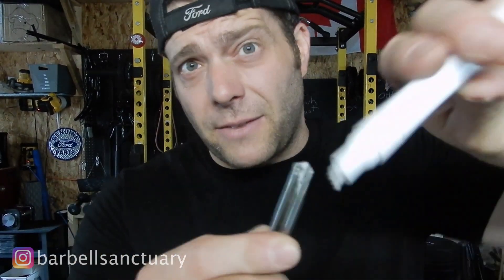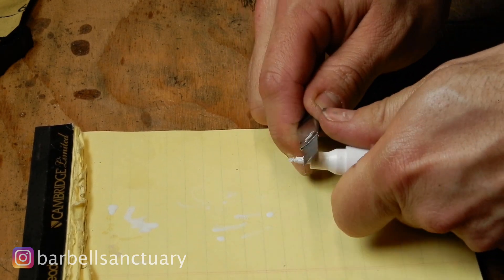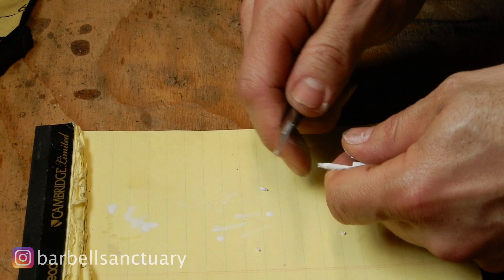For the white lettering, what you're going to need is a white paint marker. You can do a different color if you want — I like the black and white. The ones I like are the oil-based ones that have the little felt tip that goes in and out and collects the paint from inside. It's a harder felt tip than a Sharpie would have. Because they're typically too big to go into the cracks of the Iron Master lettering, I'll use an X-Acto knife and actually sharpen the tip of one of my pens just to do the lettering. I find this adds a really crisp look.